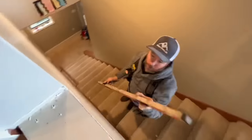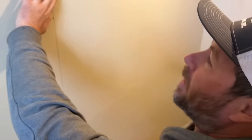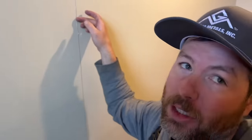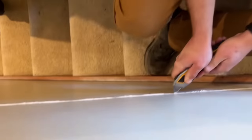Drywall surgeon! The reason I'm cutting this with a knife instead of a sawzall is this might kind of be like a finish edge — good enough to just run a bead of caulk against, to a piece of trim we're going to install. If we just hack at it, it's going to be real rough. All right, here's the fun part.